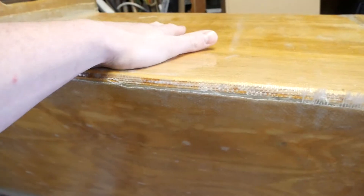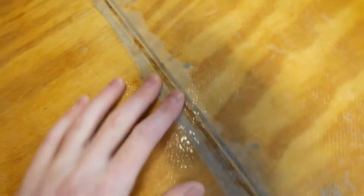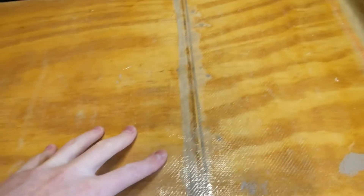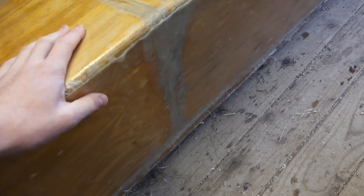Here you can see there's a joint — this is actually a completely separate hull section. There's a bulkhead down here and this bit at the end has no storage; it's completely flotation all the way through. You can see that D-shape going down. This is the joint where the second part of the hull goes on. Originally I was going to make it modular so it could bolt together, but I decided there was no point and it was just adding a weakness into the hull, so the hulls are just one piece.